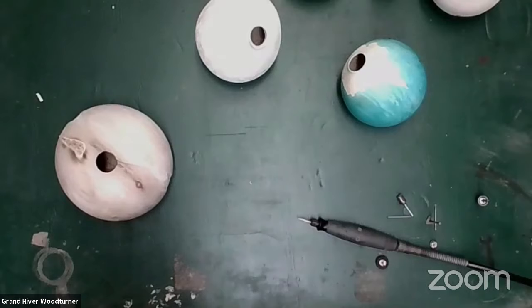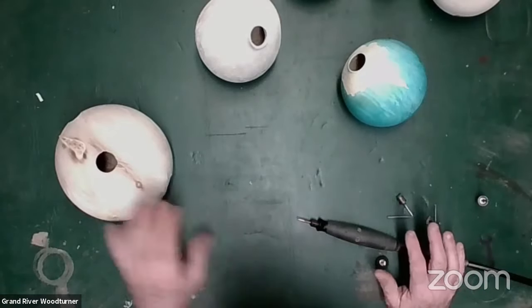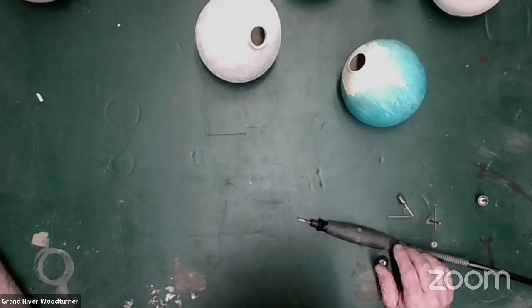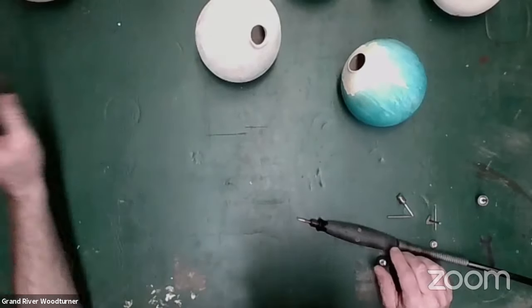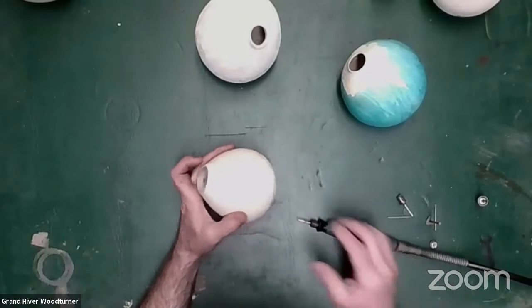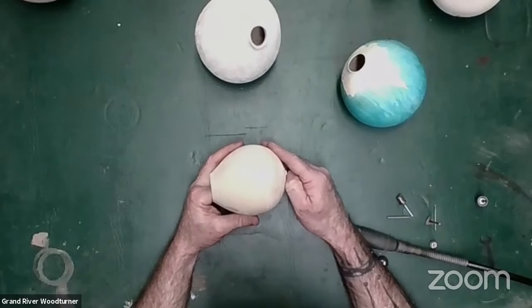If you get a piece of wood that I think is bone dry, I don't think you can add water to it again. Because I think, if I'm not mistaken, the cell structure is completely dried out and everything's closed up, and I don't think you'll be able to get water back in there. Does that make sense? Yeah, that answers this question, I think. But if it's partly dry and it's got still somewhat of a decent moisture content, yeah, I would say, turn it and then soak it. Probably have to soak it for longer, but that's fine. When you say soak it for longer, is that like throw it in a thing of water overnight or for a day? Yeah, just trial and error.